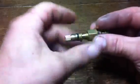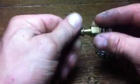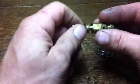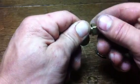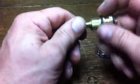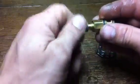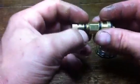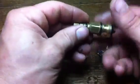Now, the thing to do then is get some silicone grease. Put the silicone grease down in here and on here. Then, with these out, you screw it in and it'll lock up on the grease, but squeeze it slowly down, so it squeezes the grease into everywhere. Run it out again. Wipe the grease off this, put some more on, a bit more in there, do it again. That makes sure you get grease all down and everywhere in it. Smear of grease around this, silicone grease obviously, and then also a smear of grease around there.